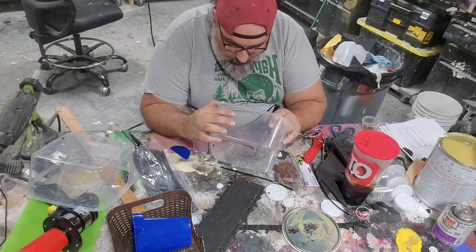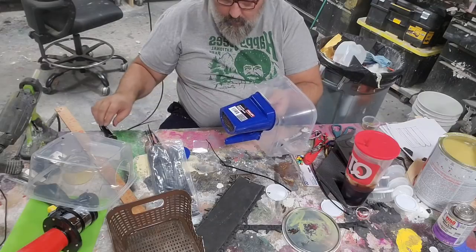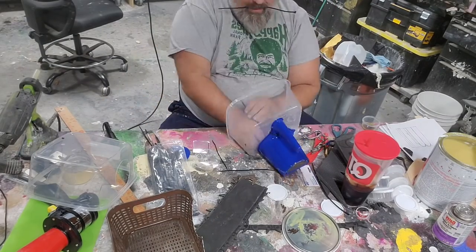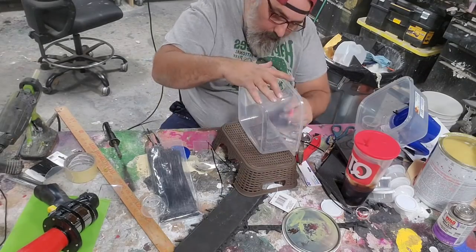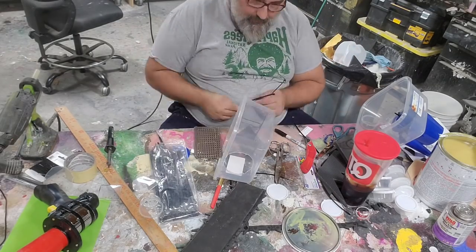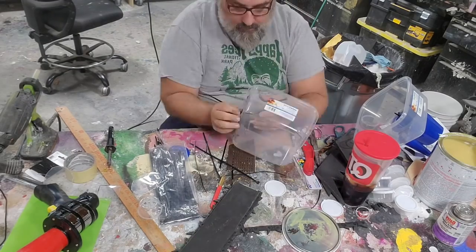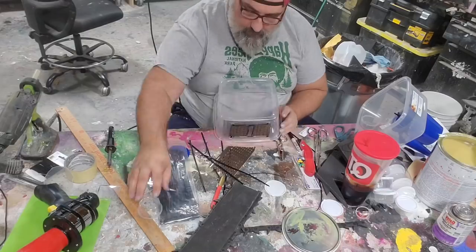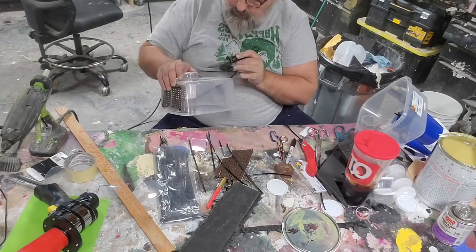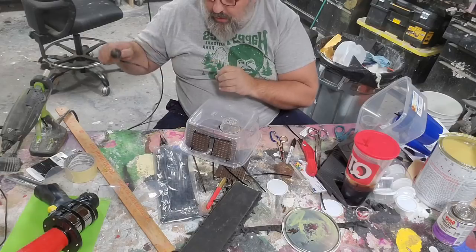I also make sure that I have some kind of ventilation going — I've got air scrubbers. I want another mounting point up here; I'm going to put two zip ties in right here. This whole build process is: cut the holes you need, use a soldering iron to open up holes in case you don't want to shred the plastic, and zip tie it together. Always use a mechanical bond along with glue. In this case it's a hot glue meant for plastic. I did a bit of hot glue on there, but now I'm also putting on zip ties. Never trust glue alone to do the job.